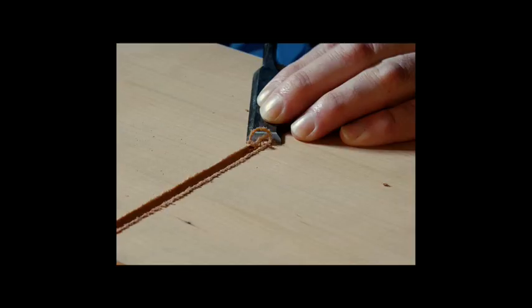Well, one of the things I also notice that you do is skewing the blade too, right? That's purposeful, right? Yeah, it's on purpose. And I guess in the other one I was skewing it as well, like a little slicing cut. Yeah, it's a little slicing cut. That works really well with end grain. It also works pretty well on the other one, where the piece that the dado was cut into is probably in the neighborhood of 8 to 9 inches wide. So skewing it, well, it does 2 things.